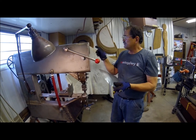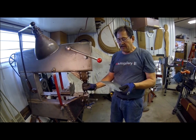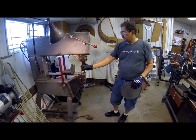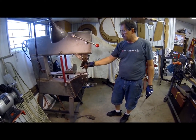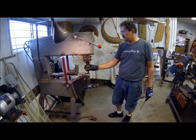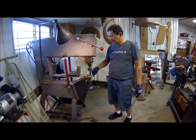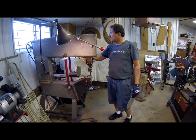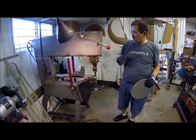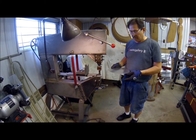What I'm going to do now is switch out the dies and put the shrink dies in for aluminum, then do a demo on some sheet aluminum. I've changed the tooling over — I've put in our plastic tooling. It's some kind of hard plastic; I'm not sure exactly what they're made out of, but what they do is they don't mark the aluminum. If you're ever going to build something out of aluminum that may need a polished finish, these are pretty handy. The steel dies will shape aluminum, but these ones shape it without marks.